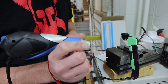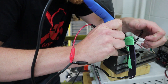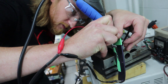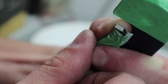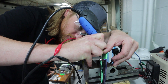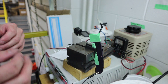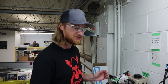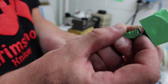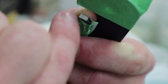It moves back and forth and has about 45 volts applied to it right now. You kind of spread the carbide on, but it's very loud and all the sparks make it really hard to see what you're doing, so it just takes being very careful and not jumping around too much. Now that's got a fresh layer of carbide all the way across the face, except for that little blue corner in the back where I missed.